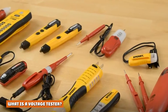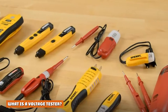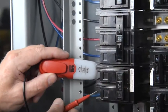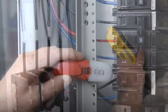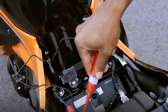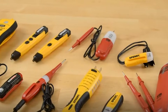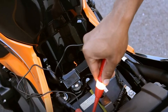What is a voltage tester? A voltage tester, also known more commonly as a voltage detector, is a simple electrical testing tool that checks for the presence or absence of an electrical charge in an electrical circuit or component. It is mainly a pen-shaped testing instrument used for electrical power testing. The device detects the electrical field generated by voltage on a wire or other electrical system to check if the wire or system is energized with an electrical potential. It can be an easy-to-use hardware that detects the presence of electricity, or a more advanced tool to detect precise voltage levels in an electrical system.